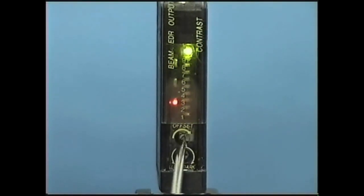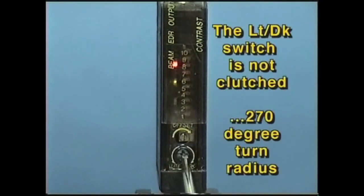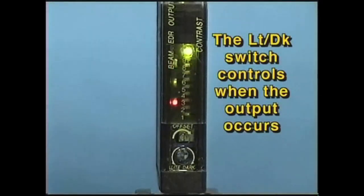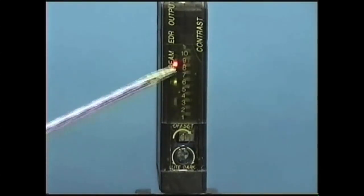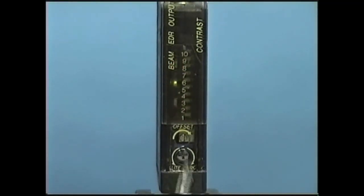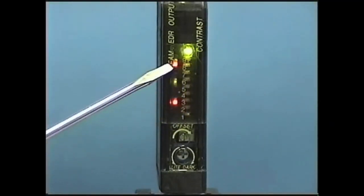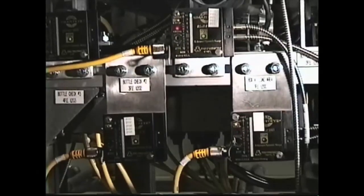The light/dark switch is a rotary switch with a 270-degree turn radius. It is not clutched — turn the switch until it stops to make your changes. When you turn the switch to the dark setting, it turns on the output LED when the contrast indicator goes down below the switching point of number five. Notice that the output LED is turning on opposite that of the beam status indicator. Turning the light/dark switch to the light position will cause the output indicator to turn on at the same time as the beam status indicator when the sensor receives light, causing the contrast indicator to go above number five — we get both the beam status and output indicators to light.